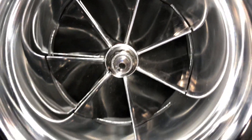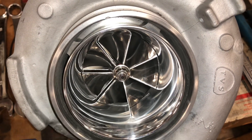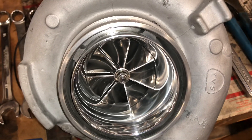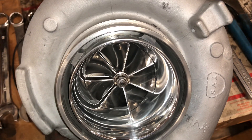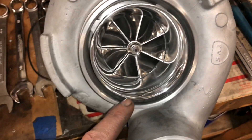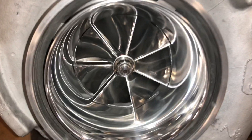To give you an idea what this is — this whole inlet piece right here gets replaced. I machine this out of a round piece of aluminum that's four inches, machine it down so we can put it on the mill. Then one of my employees uses the mill and cuts it down to make the anti-surge port and elongate the inlet out to the end. Then I go back and weld up the holes where the pins have been removed.